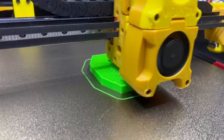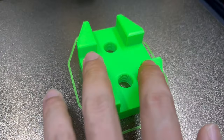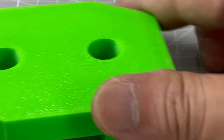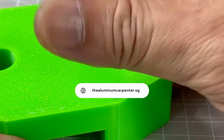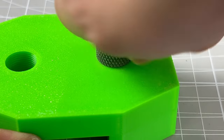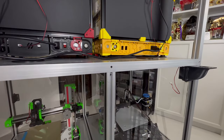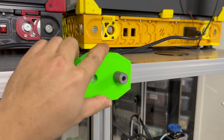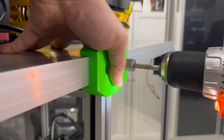This is a drilling jig that I will need, just for this job. It will accurately find the locating holes that I need to drill. Two holes will have to be made here, to run the wires out. The wires to the LED and the fans will pass through these holes. All the electronics will eventually be mounted at the back of the rack.